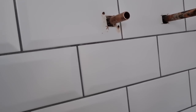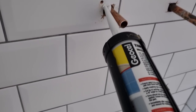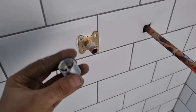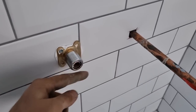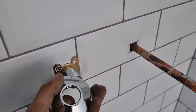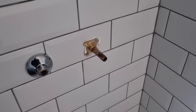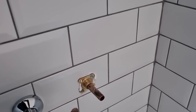All I've got to do with these is screw them to the wall. I always put silicone behind my fixings - so no water can get behind. I've only drilled two holes because there's plywood behind, which will definitely hold on to. We'll pump that full of silicone in the fixings so no water can get behind and fix the bracket to the wall. I've put my olive on - I always use a little bit of JetBlue. That will just tighten up on there. That's the second one screwed in - obviously when you drill in, be careful you don't hit your pipework. Always try and run your pipework straight down, make sure it's dead level, and then just bolt the shower valve on.